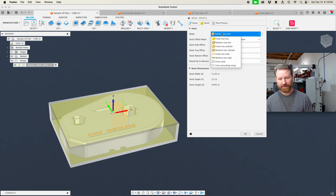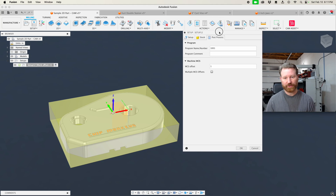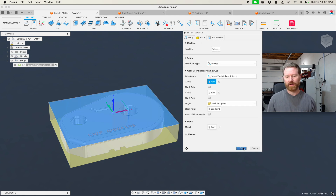This is not going to be a relative box or a fixed size box — we've already fixed it as a 3D model and we select that. Now our setup is mostly done. There are some other options in here, like you can name your program number instead of waiting until your post process, so it's static and always the same. You can add a program comment. And then your work coordinate offset — this is going to be 1 is G54, 2 is G55, G56, G57, G58, G59. So we're going to put him as 1. If you put 0 there he's going to default to G54 — he's not going to go G53 on us. Now we're going to click OK.